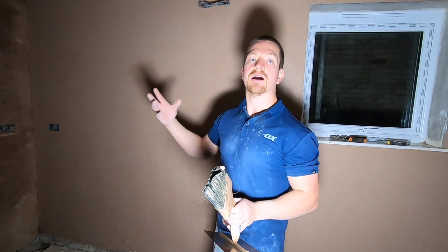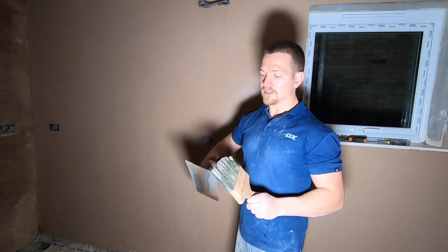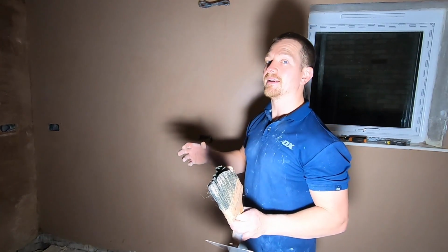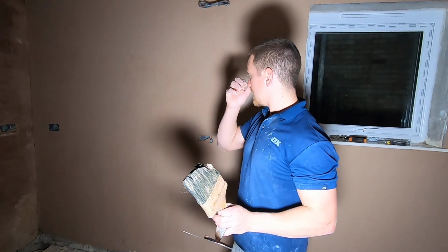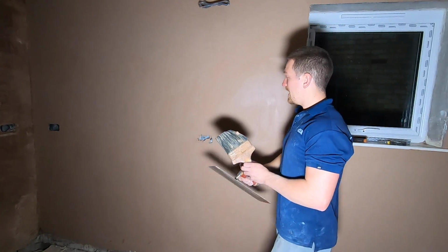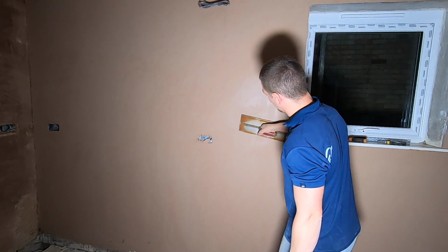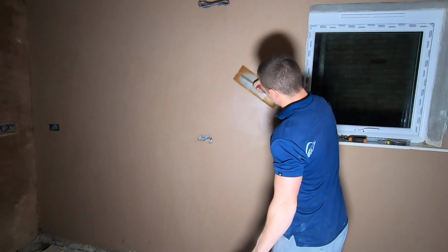And you want to be doing this around now. This is the first trowel, and we haven't got too much longer after this to start filling it in. After this point, the plaster's going to start setting. So if you have got any marks, any holes, any areas that haven't got a bit of plaster, take your fat, fill it in, trowel it in.